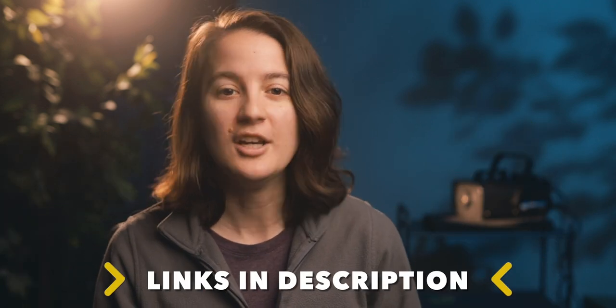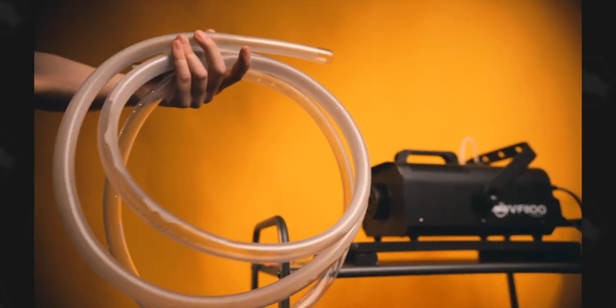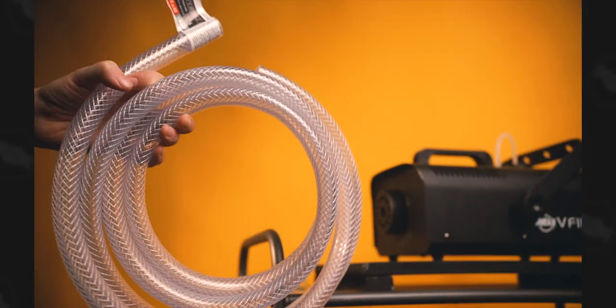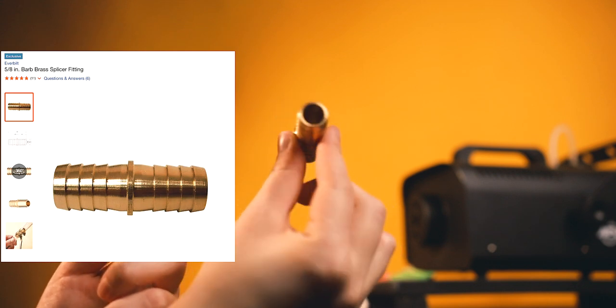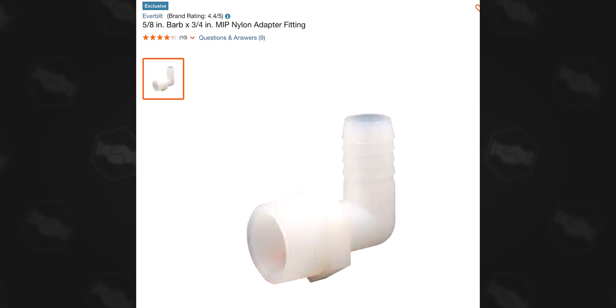This build is really important and I'm going to share it so you can get some ideas on how to build your own. I'll link everything in the description. I sourced pretty much all of the parts from Home Depot. The first item is a 10-foot clear vinyl tubing with a 5/8-inch inner diameter. I also got a 10-foot braided vinyl tubing of the same dimensions. The next item is a 5/8 to 5/8-inch brass splicer, then a variety of rubber bands of different thicknesses and strengths, and optionally a 5/8-inch nylon adapter fitting.